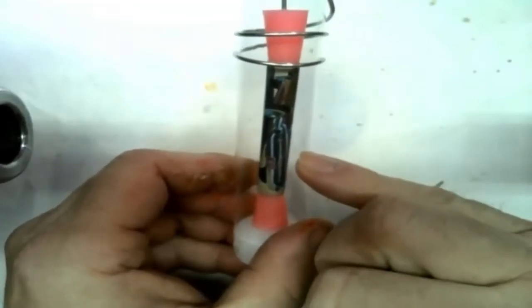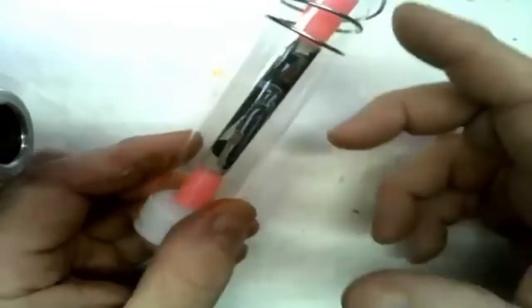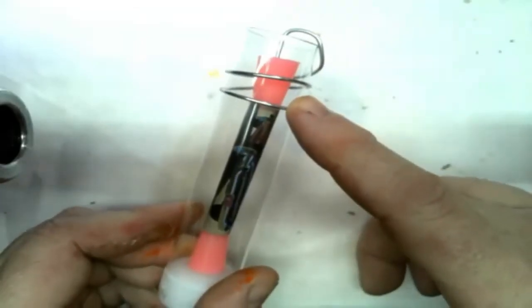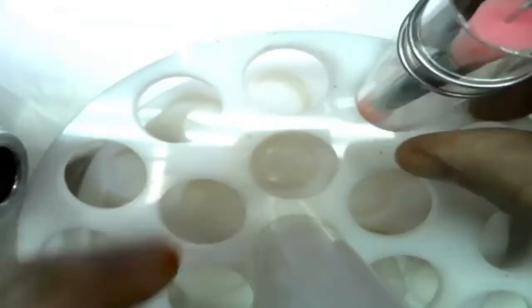We're going to use a plastic tube. We're going to use something here on the ends. They're going to make sure that our resin doesn't creep inside the plastic tube. We're going to get some sort of mechanism on it to center the top and the bottom. And then we're going to put it vertically inside my casting system, and then we're going to put it in a pressure pot.